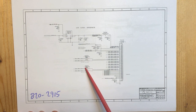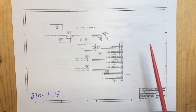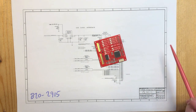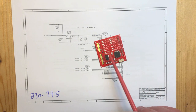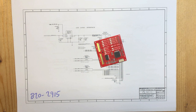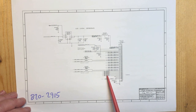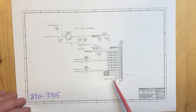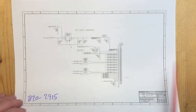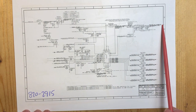In the clock lines there are little filter components - especially in the 2015 model, those are really easy to knock off. If you yank out the LCD connector clumsily on a 2015, you might knock one of those filters off, resulting in a black screen. With the Known Good LVDS screen, you will immediately see that one of the clock LEDs is no longer on. But if you just connect a real screen you'll see it's black and know nothing. This line is the backlight power, and these are the grounds for the backlight.